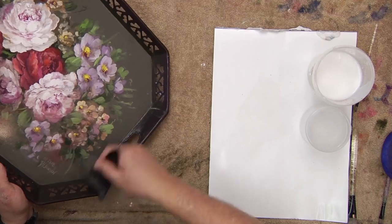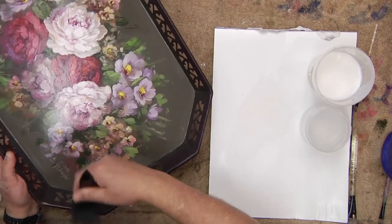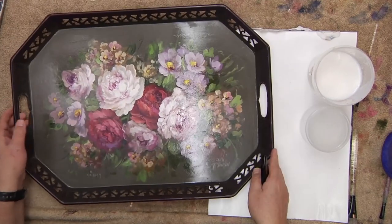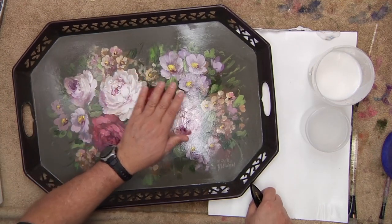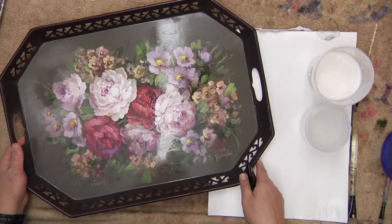You can work this all the way with real heavy varnish here. So I'll work that like that. Now, you can see that's just a beautiful coat on that right there. Now, this is starting to tack up. Even if I put my handprint in it, just like that. Now you see my handprint in it like that.